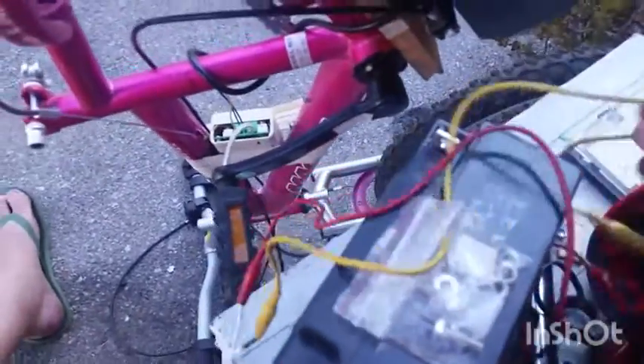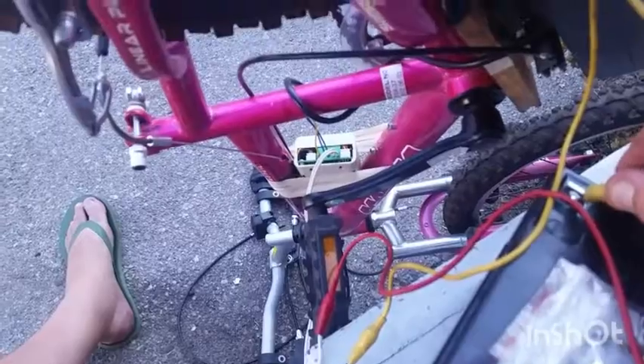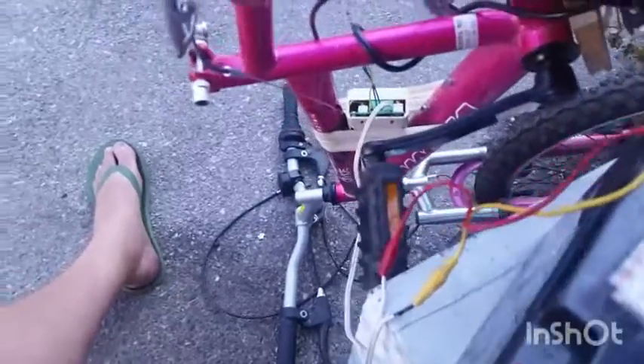Here's the wiring: on the left side are the three-phase cables coming out and feeding the motor. On the right side, the white cables — one is marked with black permanent marker — that's the DC input. We're feeding it 12 volts from right over here. We've got these two cables: the yellow is negative and the red is positive.